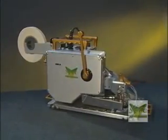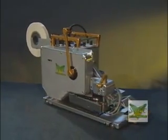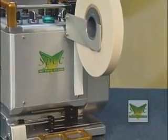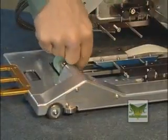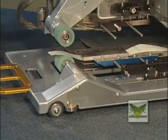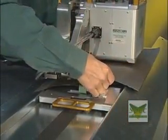The Spec Overlap Acrylic Tape Welder is available to accommodate for the thermal bonding tape when welding acrylic-coated fabrics. A hanger for the tape roll and a special front guide direct the tape into the welder. The lower guide tray contains a slot for the tape to be placed in position at the welding area. Fabric then is brought into the spec from one side and the other.